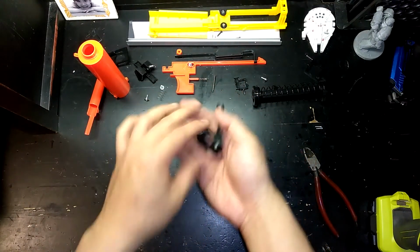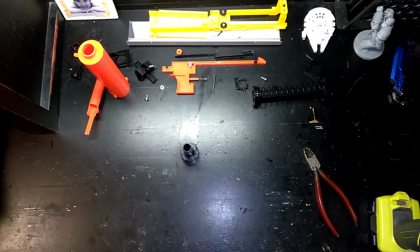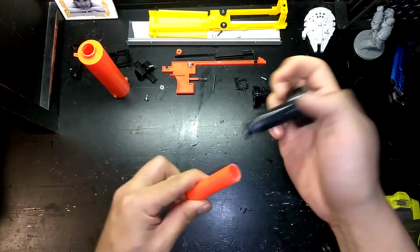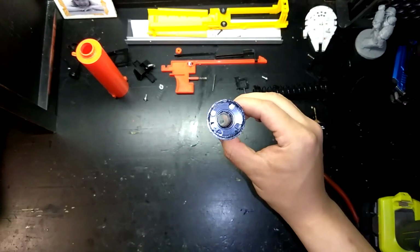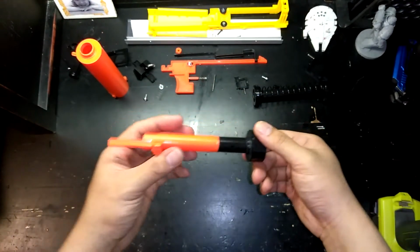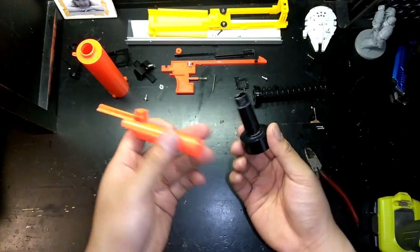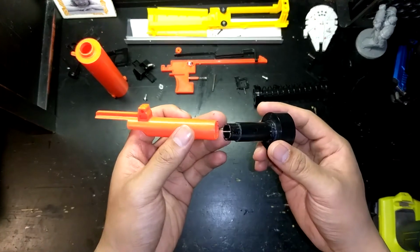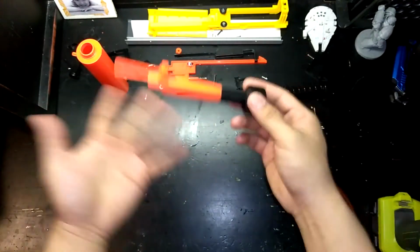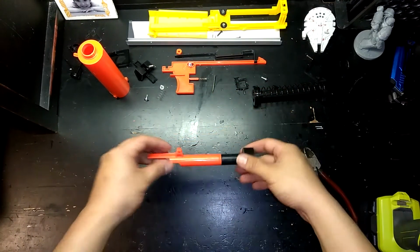We can throw all these little pieces away. So this is really good for using as a stir stick for epoxy that we will be using later. And so now we got this nice clean system. You put it back together, clean this off. You could put it back together and you got this nice straight shot right on through. And that's actually pretty much what you would need if you didn't want to brass it, and you could now epoxy this back together. So this is the reason why I wanted to show it to you this way. At this point, you could just epoxy this, stick it back here, seal up that hole, put it all back together. You've got a really nice and clean system for typical firing.